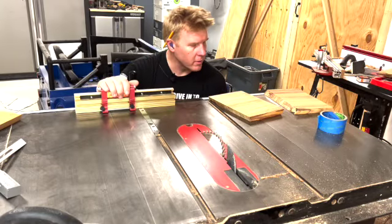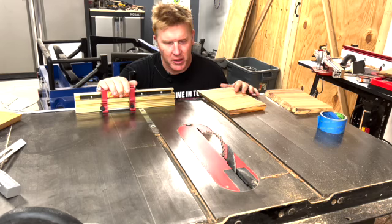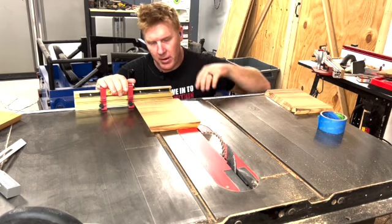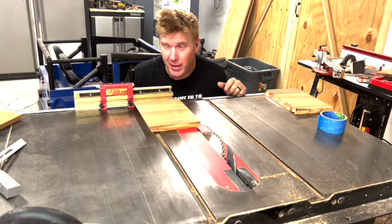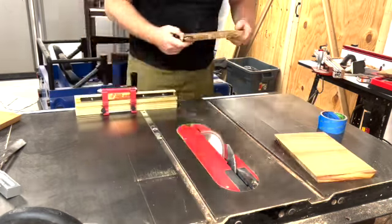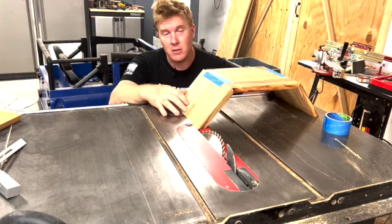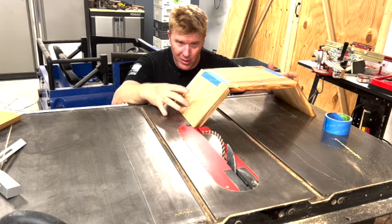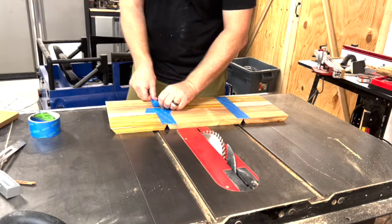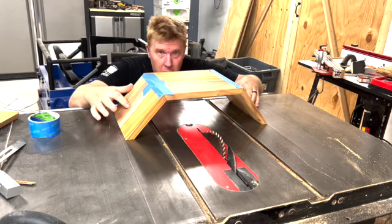I got my setup back again. I put a little arrow so I know which side to cut on, because I'm only cutting on one side — I need to make sure I don't get in the habit of just cutting and cutting or both will be off. I set my saw to the same angle: 39 degrees, because that's what the chop had said. If it works, great. If not, I'll probably have to do math and I don't like doing math. The angle — much better. So now that my sled was set correctly, I can just cut the other two legs. If I lift it up, those pieces put together nicely, sit nicely on the table.